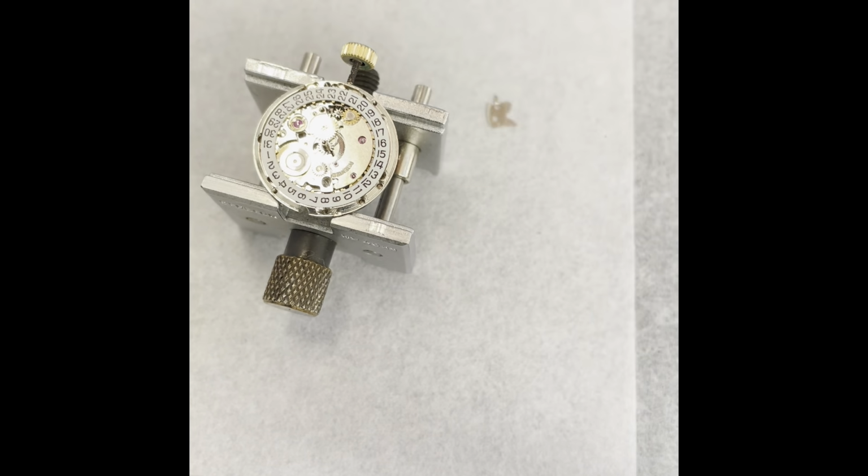Works a bit in the same way as epilam, but it's actually a greasing agent that's supposed to allow the reverser wheels to move freely, and I find that it works pretty well. I've had pretty sticky reverser wheels, and this has loosened them up and given them a few more years of life, especially handy in the case of Omega reverser wheels. Also getting hard to obtain and very expensive.